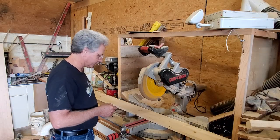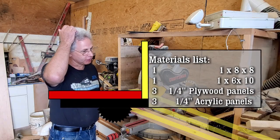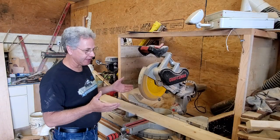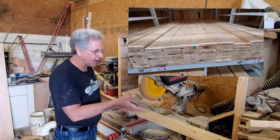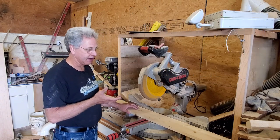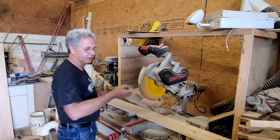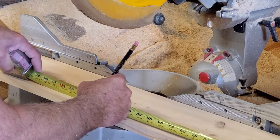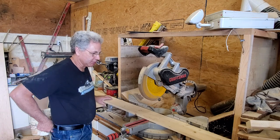One of the first things I need to do is start laying out some of the material. I'm using some number two pine that I bought from my favorite big box retailer. Our screens are going to be about five feet tall. So I'm going to lay out the first one here by taking a measure, make my mark at five foot, cut this off, and then we're going to rip these down and start to put together some of the pieces.